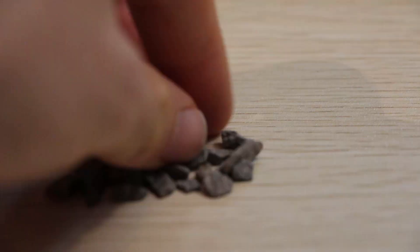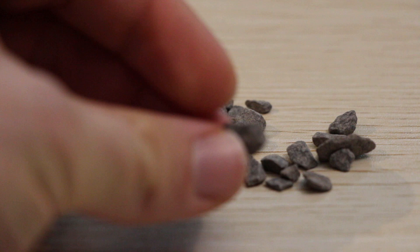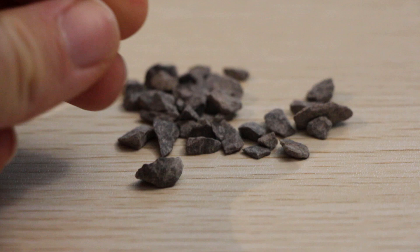So to summarize: overlays and driveways with tighter joints — I'm going to go concrete sand. Now, HPB by ICPI standards is not necessarily to be used for those applications; it is only to be used for permeable applications. That said, when I do lift and relays and there's HPB underneath with wide enough joints, you definitely see the HPB coming up through the joint, meeting that polymeric sand, and with that slight bleed-through you do get that lockup.